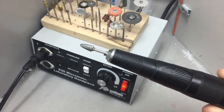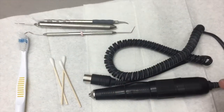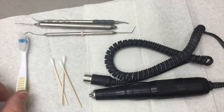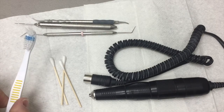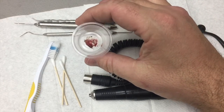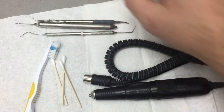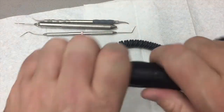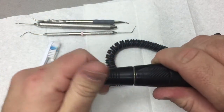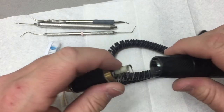So we're going to take this thing apart and get in there and try to fix it. Some of the things we need, obviously, is the handpiece. We have a few Q-tips over here, some old dental tools that I've been given by the practice, a toothbrush, and here we actually have some grease — that's what we're going to repack those bearings with, depending on if they're not too deteriorated. So let's just take this thing apart. Basically, you twist it and that pops out right there.